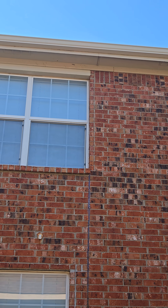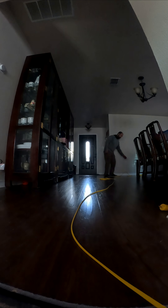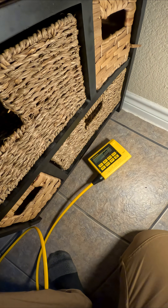all visible signs of stress had corrected, but the front door starts sticking slightly. That's usually a good indicator that the house was originally built with a very small natural slope. So we lowered it just one tenth of an inch, and the door starts working again.